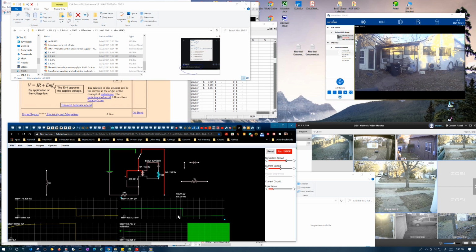But again, it may be the half a volt here, but at a higher current. I don't know. I'm just kind of astonished, because when it's a one-to-one turns ratio, it's not the voltage that's important, it's maintaining that current. In theory, the equivalent current should be half an amp. Why isn't it trying to maintain that? And if it were, the value of this resistance should dictate what the voltage is, not the turns ratio. The turns ratio is evidently determining the current, but I wouldn't expect it to determine the voltage in this case.